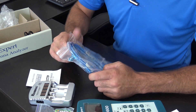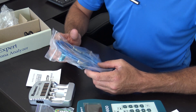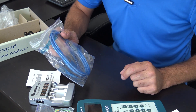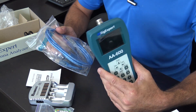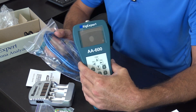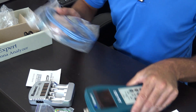Think about this — do you think someone like DX Commander, Callum in the UK, just wings it and says 'I'll build this antenna and make you use a tuner'? No. People who build antennas, coax stubs, and matching networks use an antenna analyzer, not an antenna tuner. That's why it's important to make the best of your antenna with an antenna analyzer.